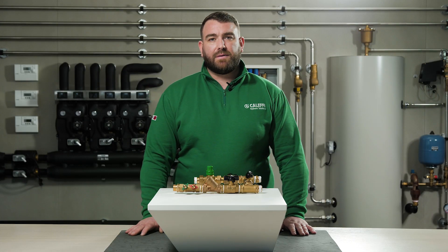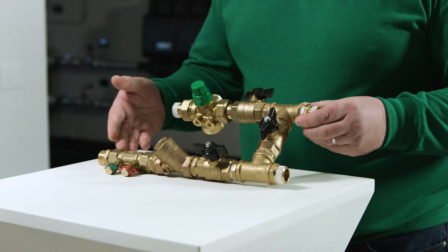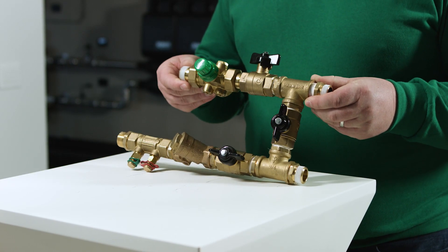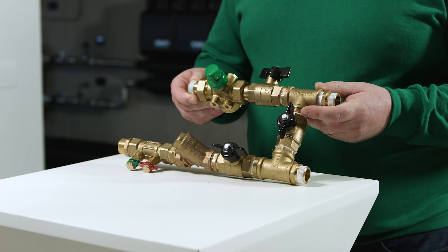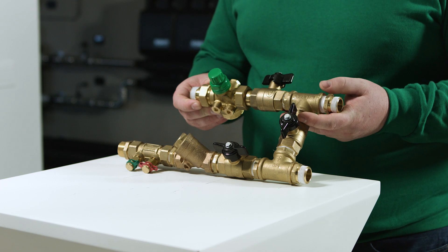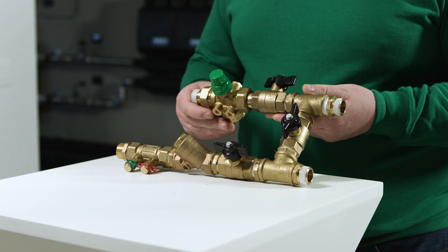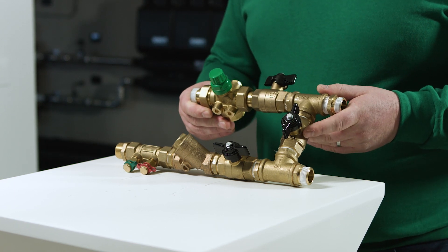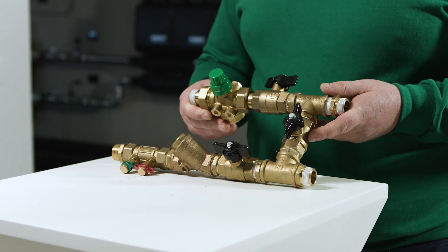All of these connections together mean that we have 20 hydraulic connections in the unit. This means a greater space for installation but also a longer time for the installer. Once this process is complete we have to regulate the flow for each terminal unit. This is achieved by selecting the correct valve set point on the PICV. Due to the complex functions and requirements we must use a series of different components to enable us to achieve the correct outcome.